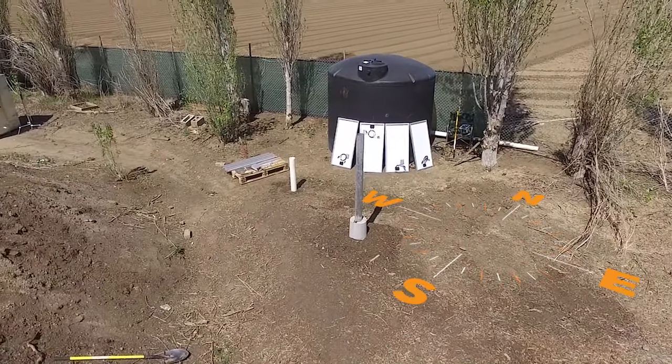We've double-checked all our connections and we're finally ready to start dropping our well pump down our well. This is doable with one person, but two people is even better — it allows free hands to lower the pump while the other person helps feed wires and grab the pipe. What you want to avoid is your drop wire rubbing or pulling tightly against the well casing as you lower it down, which can damage your wire or pull your splice loose. We want to lower it by our poly pipe — at the end everything's going to be hanging from the poly pipe with no load on our wire, rope, or sensor wire. I like to use a moist towel or rag when dropping it down, feeding the poly pipe and wire through it to wipe up any dirt or debris and keep our well clean.